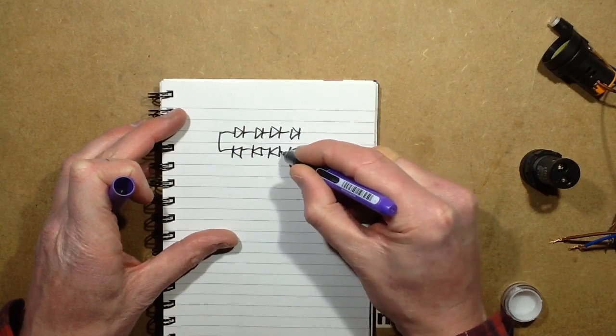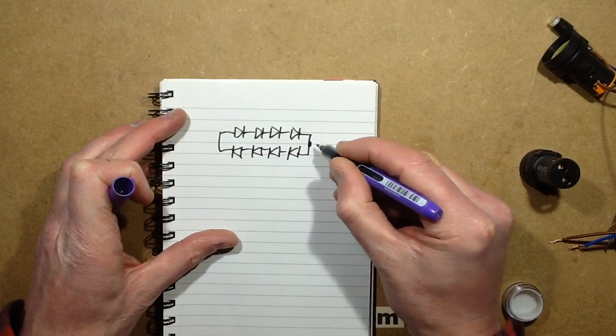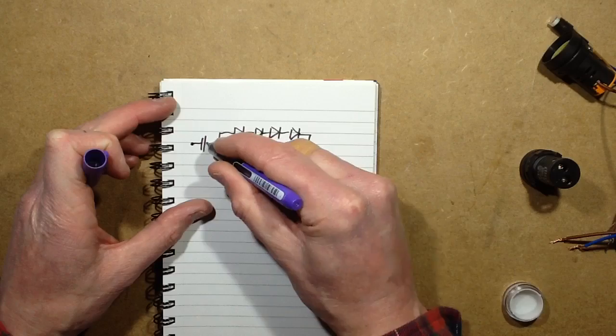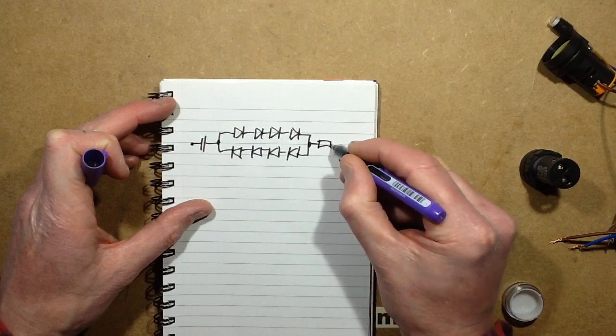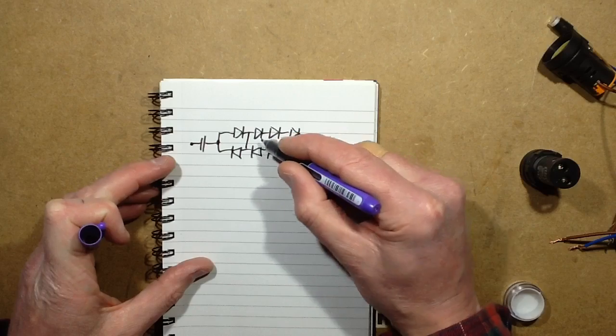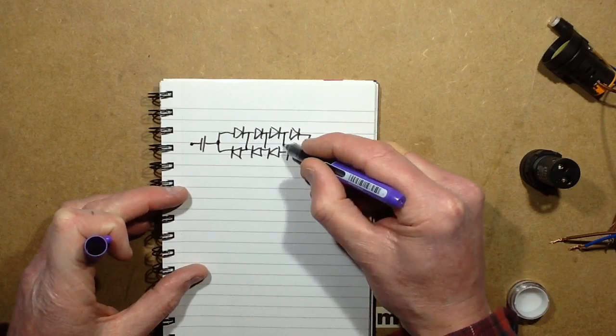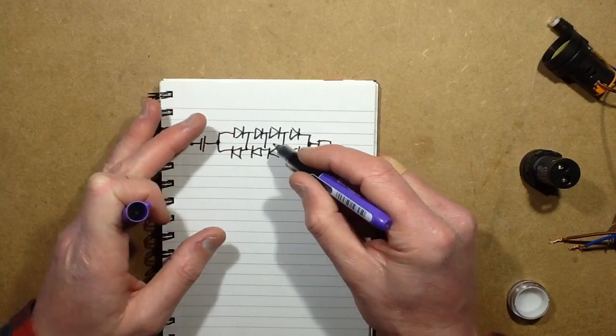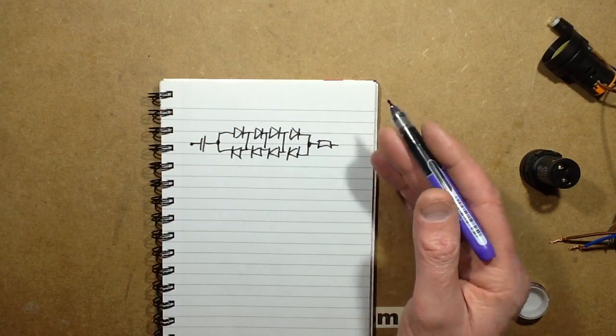And it's a fairly common approach. I've seen this used elsewhere before. It's very simple. It means that in this case, theoretically, all you need is a capacitor and a resistor to limit the inrush current, and that's it. And another thing they can do, since it's all on the board anyway, is bond it across like that, so the maximum reverse voltage any of these LEDs will see is the forward voltage of the other one. It's a very simple arrangement.